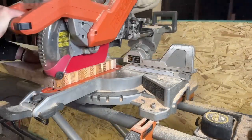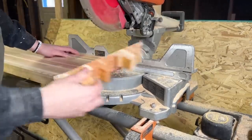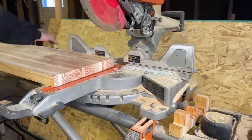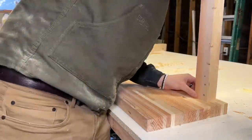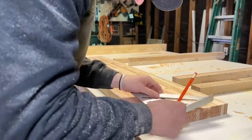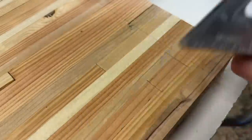Now I'll clean up both ends of my slab in my miter saw. I don't have a fancy track saw or a sled built for my table saw yet, and thankfully it fits in my miter saw. Now I'm going to lay out and see where the legs look best on the top — I think they look great here. Then I'll come over and put some marks where I'll mortise out the wood to receive the tenons on the legs.